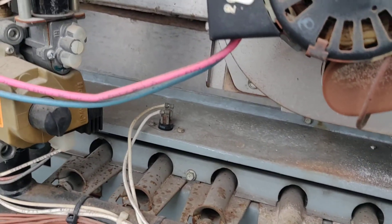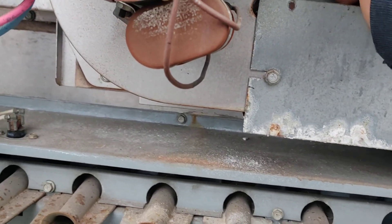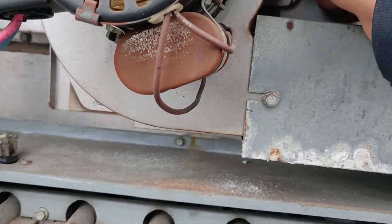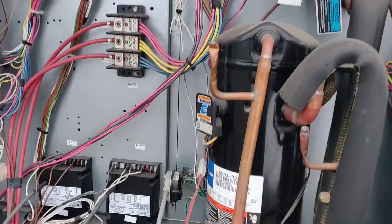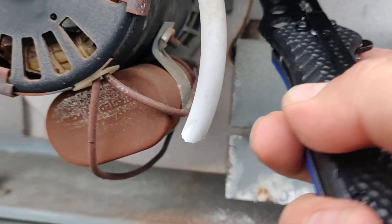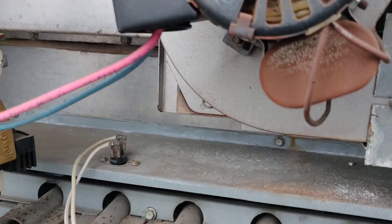Now plug it back in. We disconnect the other end — and it's toasted. That's what happens to those hoses because the inducer gets hot and it toasts the rubber of the hose. Took that section out, now it's clear.